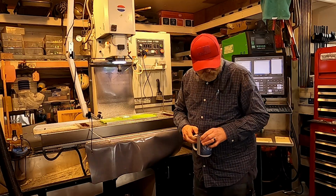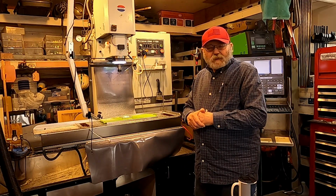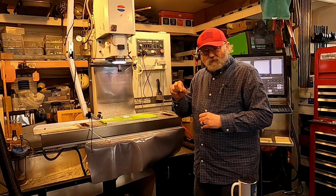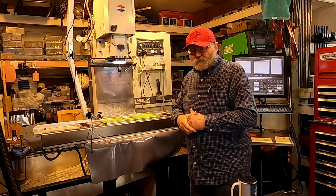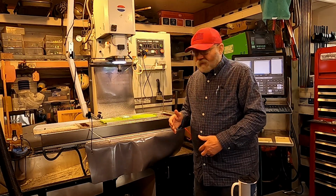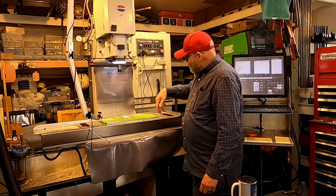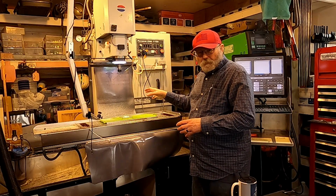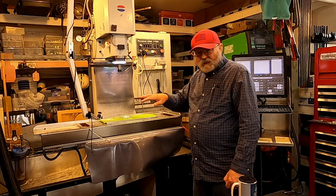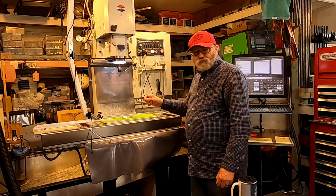The other thing that's been bugging me is in the middle of both the Fabrats and Matt's off-road recovery plaques, I've had a finishing pass that had a little imperfection in it. And I finally figured it out, something that I read about a long time ago, but it's happening to me. My machine has an automatic oiler, so every 4 hours it lubricates X, Y, and Z, whether you're using it or not. Well, if you're just making a regular cut, you can't really notice it, but if you're making a finishing cut that you want to be glass smooth and the oiler comes on, it perturbs the ways enough that you can see it in the finish.